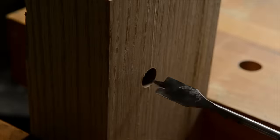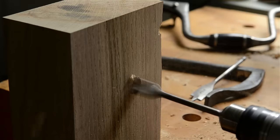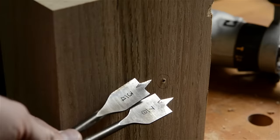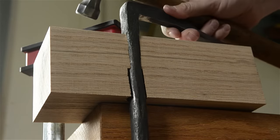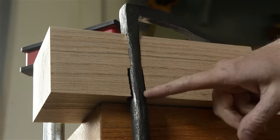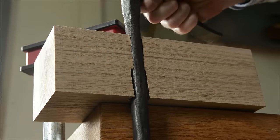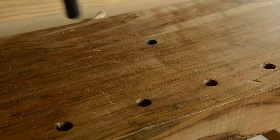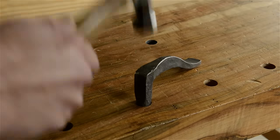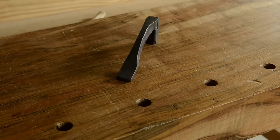Holdfast holes are made in just about the same way, except I usually use a slightly larger spade bit when coming back through the bottom — for example, 7/8 inch when I'm doing 3/4 inch holes. I bore up an inch or two and the larger hole helps the holdfast have more room to wedge itself. A holdfast hole can go just about anywhere in the workbench top; it doesn't need to be in a consistent row. As a side note, I don't like to use my holdfast in the bench dog holes — I've found that it tends to stretch the dog holes out over time, so the bench dogs don't fit very well after that.